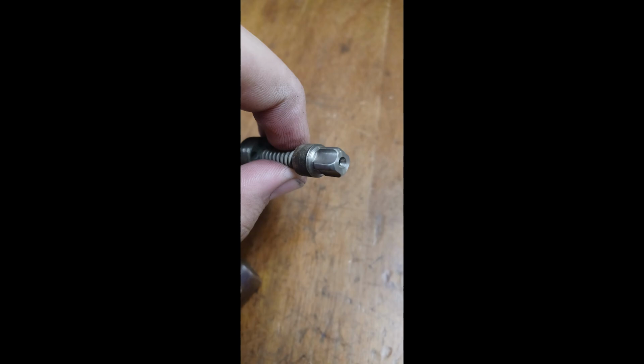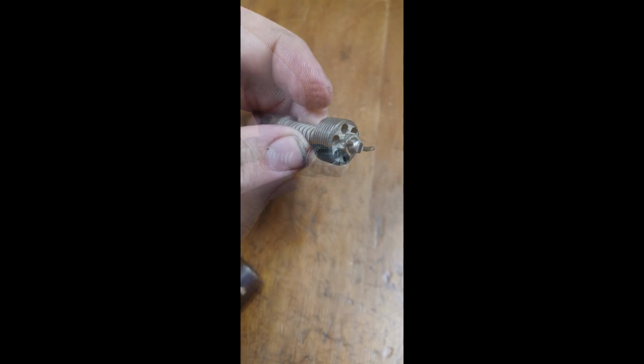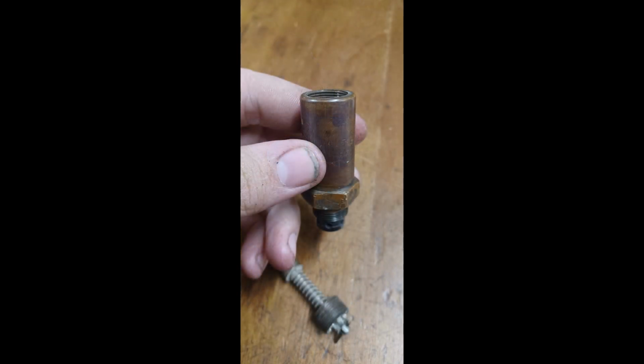A couple of things, if you're a mechanical engineer and you're into all this kind of stuff, you've probably noticed a couple of things. One being the safety valve was still lifting way below its blow off point, shall we say, and two, yeah, it does bounce about quite a bit. I have realised recently that one or two of the leaf springs on one of the corners, I've got a weak one, and the other three are sort of strong, so I'll have to sort that out.